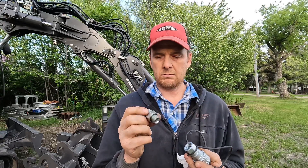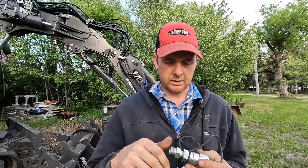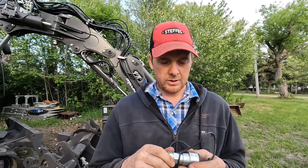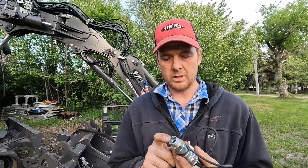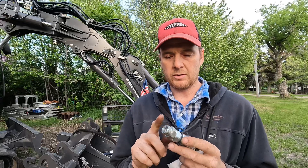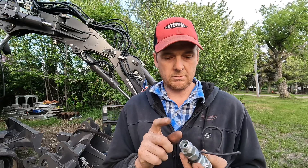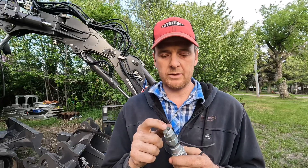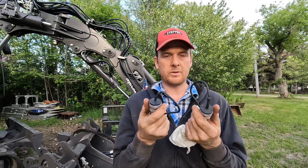It's a little bit hard to come by. I couldn't find anybody local that had anything like that. I went to the local John Deere dealer and they had this thread in a hydraulic hose. So I went to RDO, the construction side of John Deere, and they were able to make me up a hose with a DIN on one end. In my studying, I found out there's a DIN heavy duty and a light duty, and this is the heavy duty. It comes in different sizes.